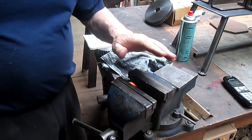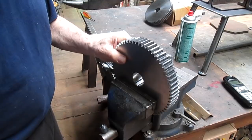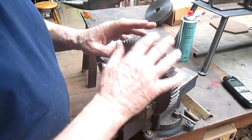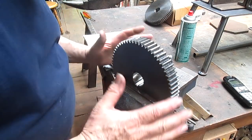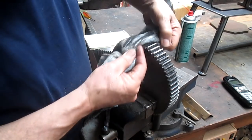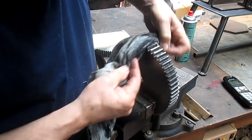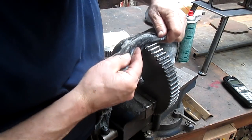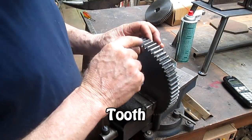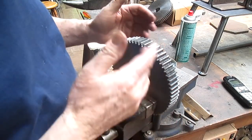Okay, we welded up the main gear, the drive gear, and now we have to continue while we let that thing cool down because it got pretty warm. Basically it destroyed teeth on all of these gears, but it's not real bad, just bad enough. I think the reason is that they put grease on these gears. Grease will keep the gear nicely lubricated without too much maintenance. But the problem is when you break a gear, instead of it just rolling around and falling on the ground, it gets stuck inside, goes round and round, and chews everything up, which is basically what happened here.